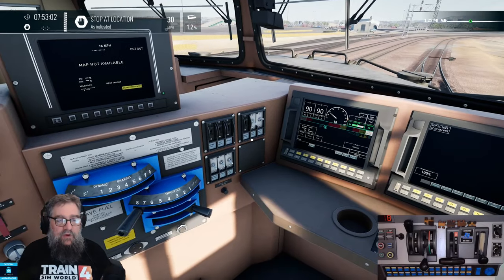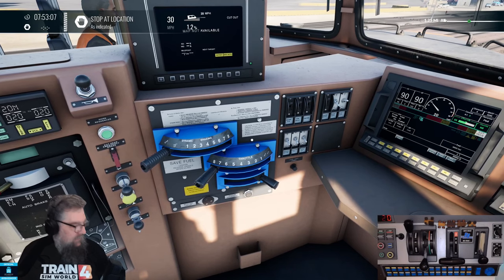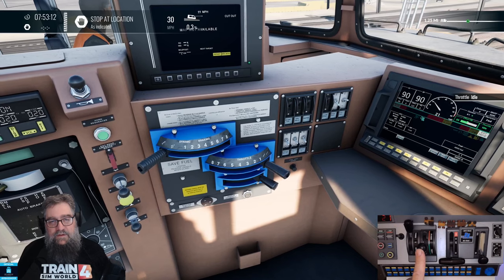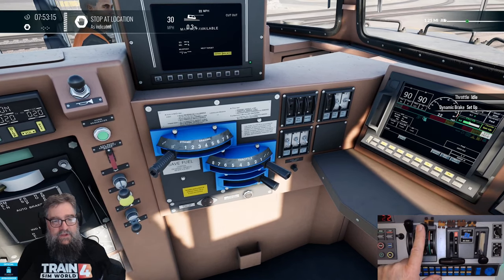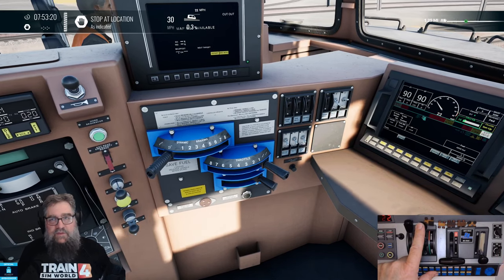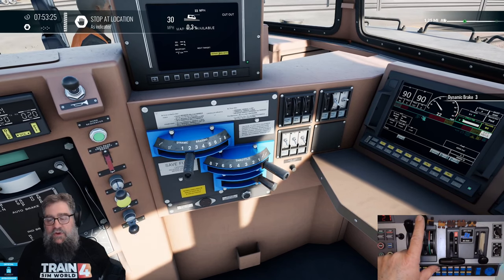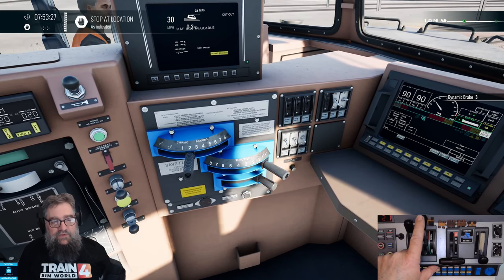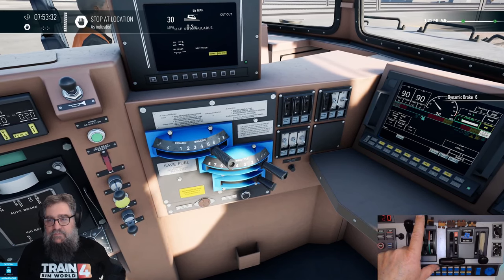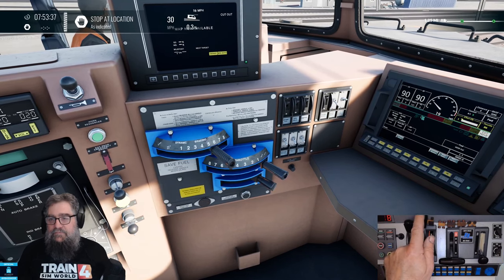What about the dynamic brakes? Because there's two handles here — a throttle handle and a dynamic braking handle. As you throttle back down, come back down to the idle position and you cross the bridge. You notice the dynamic handle went into setup when I crossed the bridge. Give that a momentary few seconds, and then we can continue on into the dynamic range and we will start dynamic braking. It's still controlled by just the one lever. We should see that starting to have an effect soon — there it goes.